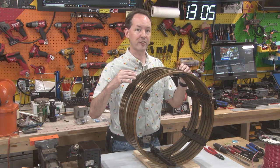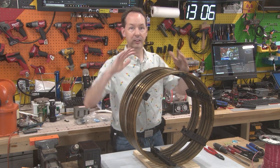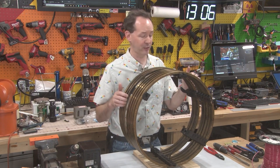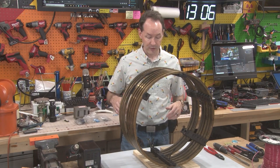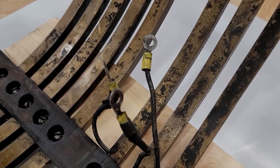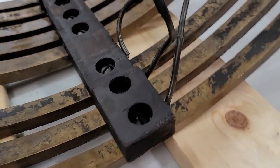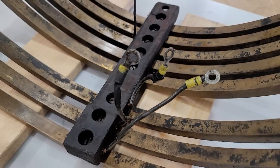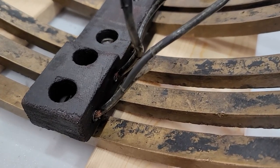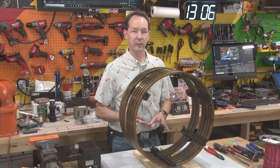These three have to stay because this is the drive power for the blade angle motor — which they don't call the collective pitch motor, but they should, because that's just how I think of it. I'm a helicopter guy. So we're going to remove these five rings. And you can see the old main power leads in here that feed from the rings down into the motor are just disgusting. These are horrible — they're old, they're crufty, the insulation's breaking off, they're not waterproof connections. These are old school, just vinyl connections, and we're going to give this a major facelift.